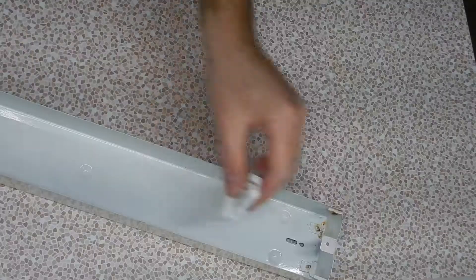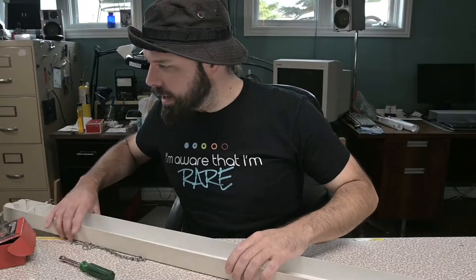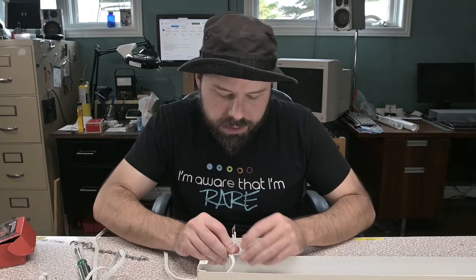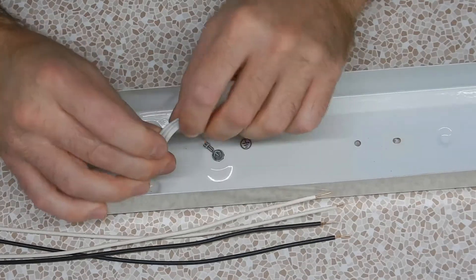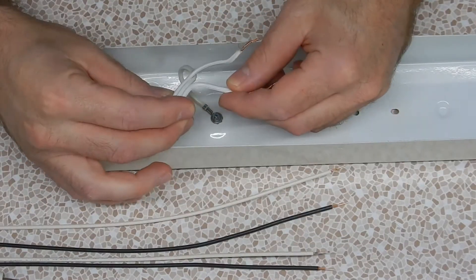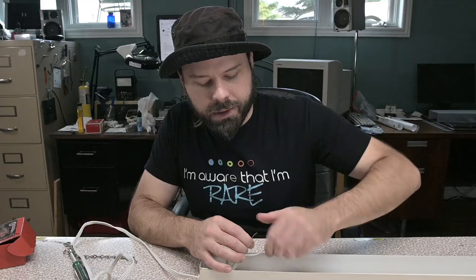On the far end, we can just go ahead and slip these in there — we don't have to connect wires or anything to them, just schlep them on in there. Now, you've got to mind the polarity. This is a three-prong grounded fixture, so black to black, white to white if it's a fixed light fixture that's permanently installed into your ceiling. Otherwise you have to do a little bit of reading between the lines. On these wires, you'll often notice one has bumps or ridges and the other side is smooth. Typically the bumpy side will be the neutral and the smooth side will be the hot.